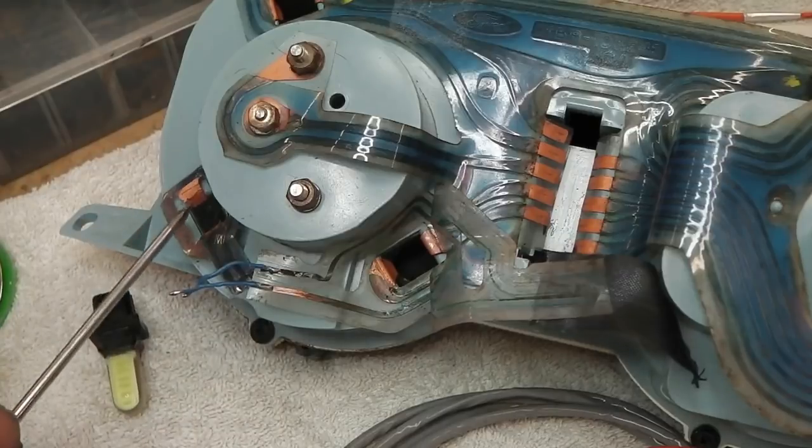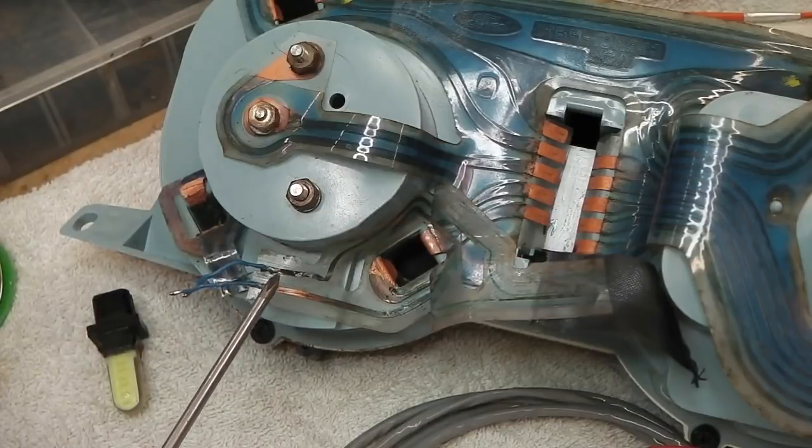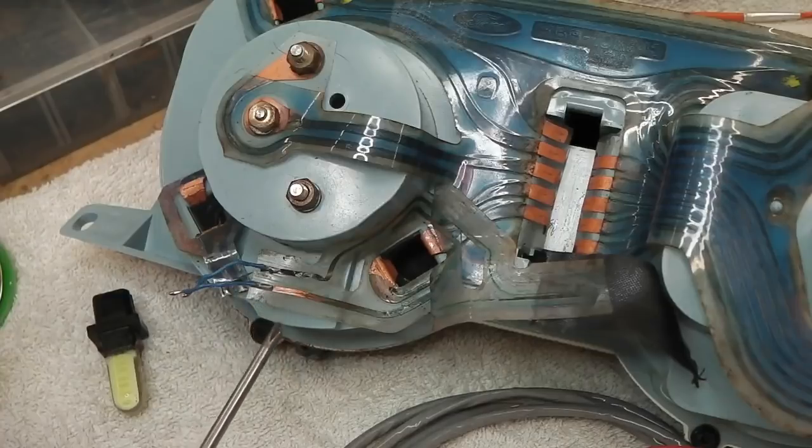But before we do, I'm going to use some adhesive and hold this in position, otherwise it's going to be flexing. We're going to use a hot melt gun and lock this in place and lock it down. Put the patch leads across, and that should have repaired that bulb holder for the indicator, that is. Let's see if we can do that repair, and then we're almost finished.